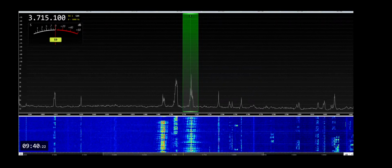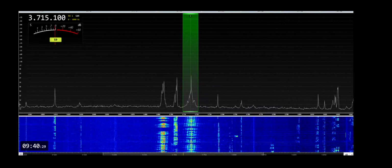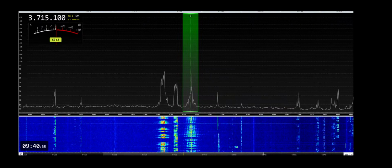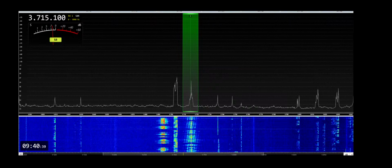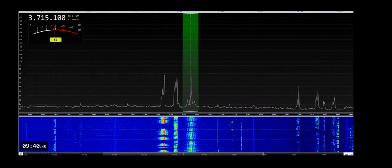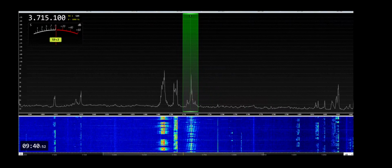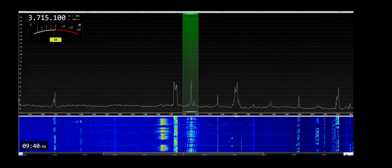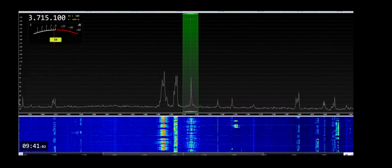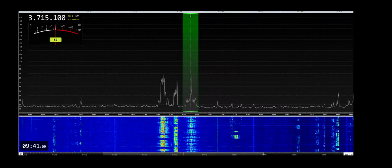And as far as tuning up the grounded grid amp, particularly the 3001, I figured out that that tune control only works with the Collins equipment. And when I'm tuning grounded grid, I'm looking at power out as well as plate current and grid current. And that's pretty much how I tune. I noticed one thing on my 3001, it does not have an opening to adjust that tune control adjustment that they mentioned in the instructions on it. So if you were to try to make any adjustment, you would have to override an interlock there, a high voltage interlock. But anyway, I tuned it based on power output, particularly anytime I'm tuning a grounded grid.